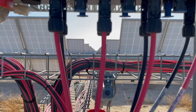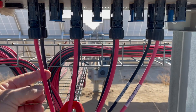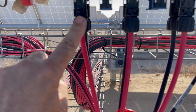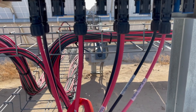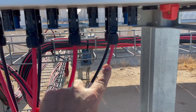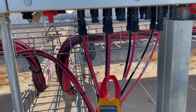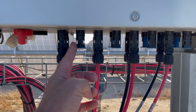What we have here are four home runs. Channel 1, you can see the wires are a little fatter than channel 4 because they parallel two strings together, so this should be double, double, double, and single power — two strings paralleled on each of these three channels and one string only on the last. They paralleled them with Y connectors in the array so they'd have fewer home runs coming into the inverter; otherwise they would have used both connectors.